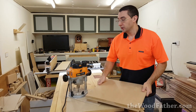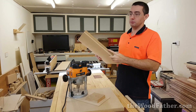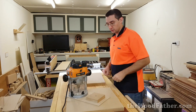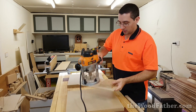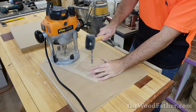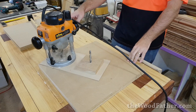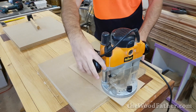Time to make the wheels for the bandsaw. I've got two blanks glued together — they're 16mm MDF and 12mm MDF, so it's about 3cm thick, two of those. On the router I've got a very crude circle jig, and basically I'm going to put a pin through here, through the centre of the wheel blank, and then spin it around, and hopefully end up with a wheel with a diameter of 40cm.